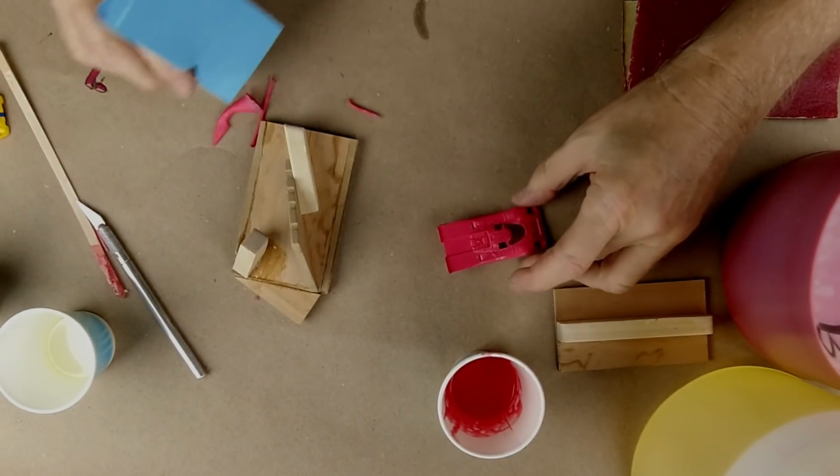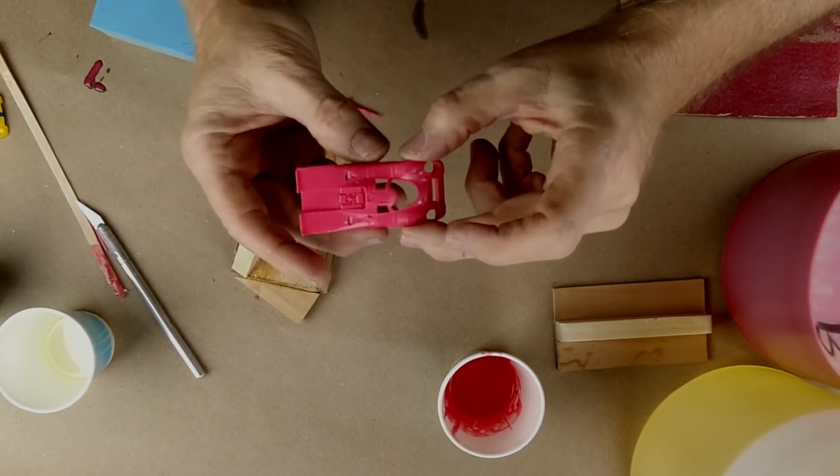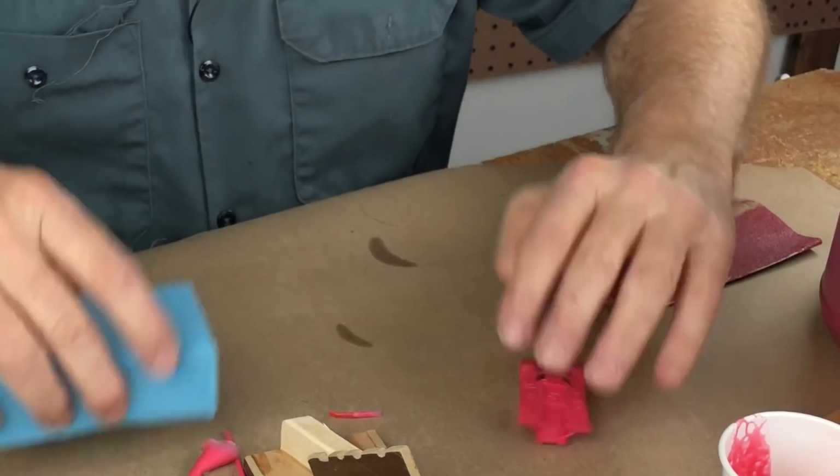Holy moly. Wow, you guys, I'm super pleased with this. And actually, I'm not gonna lie, I'm pretty proud of myself. I have dreaded this project since the day it was sent to me. I just went, how in the heck am I gonna cast this? But what I'm really most pleased with, and as a technique, one that I'm planning to use again, is this business about pre-making the parting lines on the interior surfaces. Remember, I made the parting lines out of rubber on all of these interior surfaces, and then I sprayed them so it couldn't stick, but the backside did stick, and it all made a block mold, a cut mold.